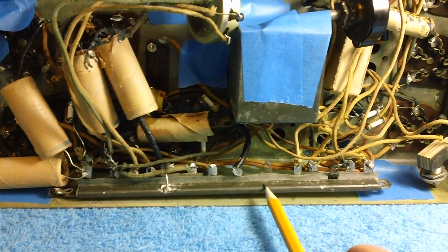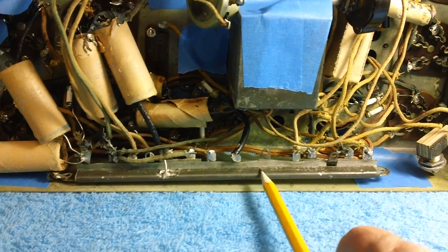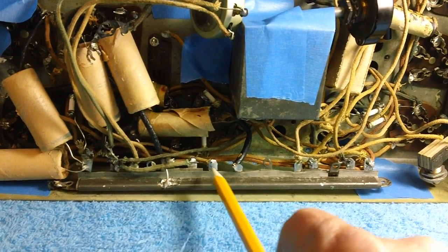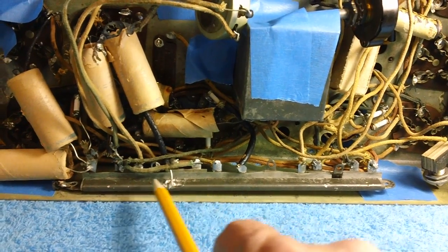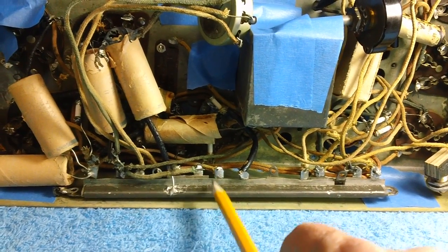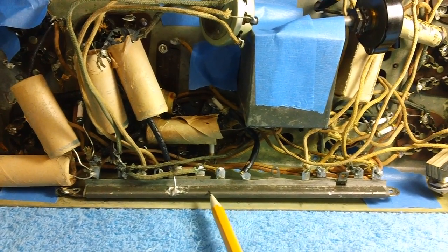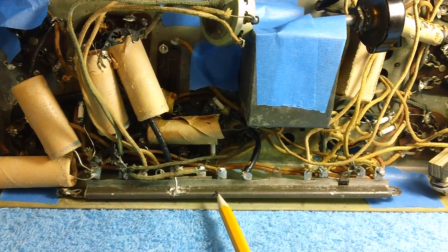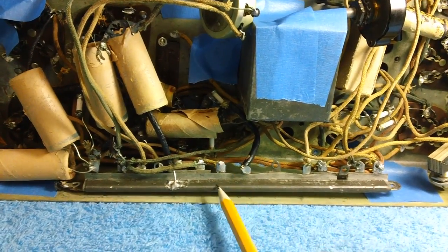I was cautioned by a very experienced radio tech one time. He said, yeah, you go ahead and put your resistor between here and here to make up the difference where it might be open. Everything reads good. And then later on, this thing comes back alive. It just comes back to life, and now you've got double the resistance right here, and it causes all kinds of problems. Get rid of this junk.